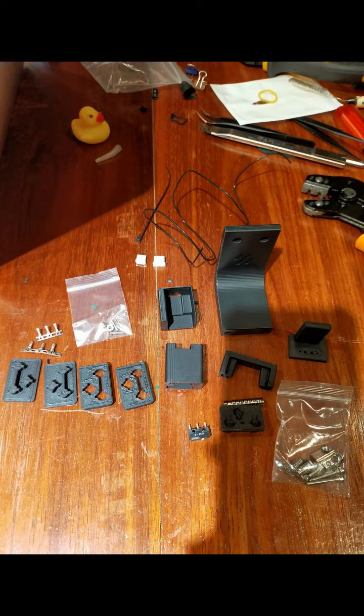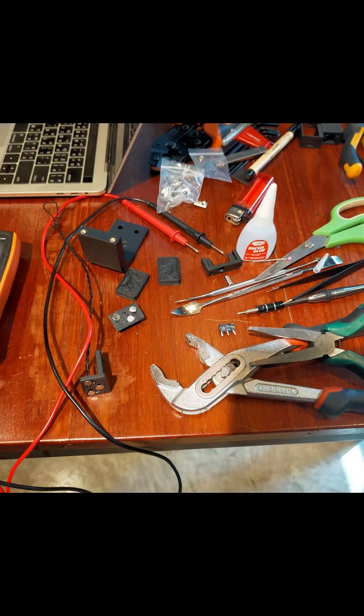Here are all the parts. It is quite tricky to assemble the magnets. You have to be aware of the polarity of each part — incorrect polarity will cause a nightmare. I'd suggest applying glue to one magnet at a time. While all the magnets are still attached to each other, put them into the hole, then slowly remove the magnet sideways and leave the one in the hole. This way you ensure the correct polarity for all the magnets you assemble.